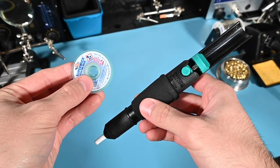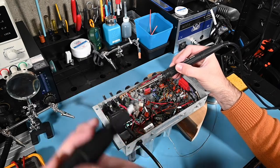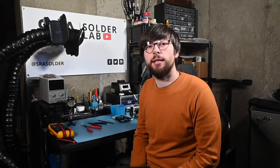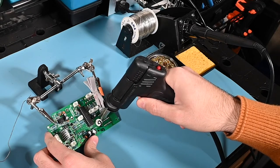If you do happen to get a bad solder joint or component while soldering, the good news is that you can just reflow the joint and replace it. Removing the old part can be tricky, and you run the risk of damaging the component and pads on the board by spending too much time on it with your iron. The two most common tools for desoldering are the desoldering pump and the solder wick, which both work well, but you still need to provide a heat source and it can be hard to juggle both tools at the same time. The desoldering pump can remove a lot of solder at once, but it quickly gets clogged and must be reloaded manually. A desoldering gun solves both of these problems by heating the joint and sucking out the solder with one tool. When I have a lot of solder joints to clean, like on an IC or a row of transistors, this tool is an absolute lifesaver and a time saver.